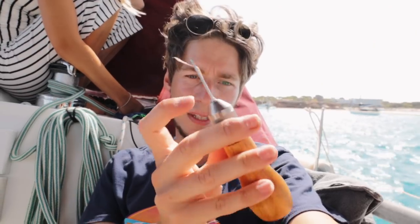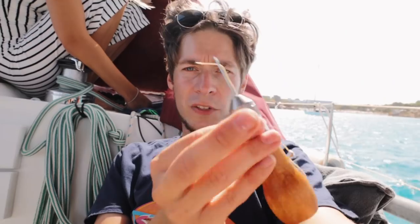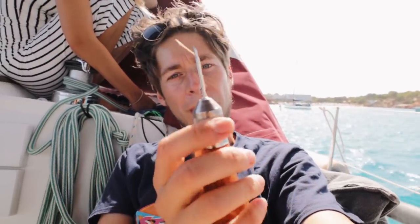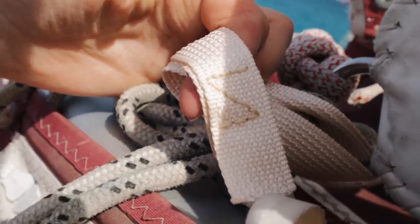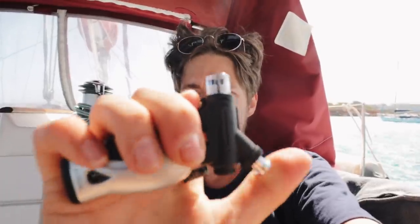Another nice thing about this method is that the line, the thread in this speedy stitcher, is waxed. It's called whipping twine and the way you end your stitch is with a lighter. You just light the ends of the twine and they shrink. Once that twine has shrunk down and you have a little bubble on top, you just hit it with your lighter and make it into a nail head — then that won't come undone. It won't go through the hole anymore and it's going to be stuck forever. I recommend a storm lighter because you will probably do this while on an anchorage in heavy winds and it will always work.